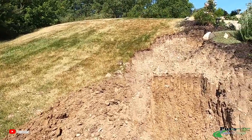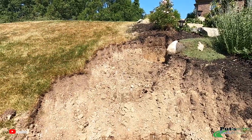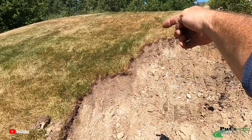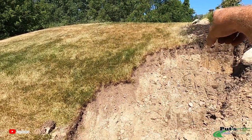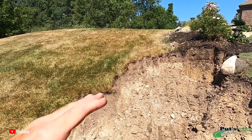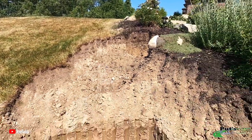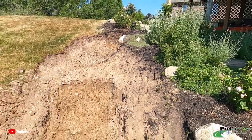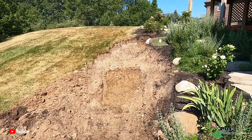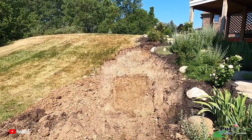Now, easier to see up in this area here, water can come down this slope and go right into the pond. So what we're going to do on this is we're going to take any of the excavated soils from here, put them up there, create a little bit of a boulder wall, bring our stream boulders up a little bit higher to retain that, and then this water here can just flow down this way. So that way, again, we don't want stormwater runoff into the stream. We don't want it underneath the liner. So that's why, as pond builders, we have to build slight berms along our work so we don't get water trapped in underneath the liner.